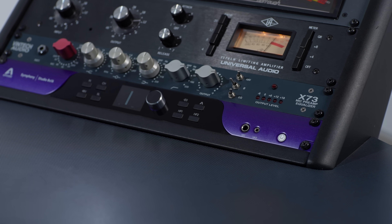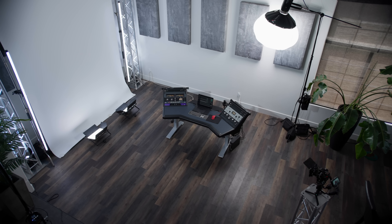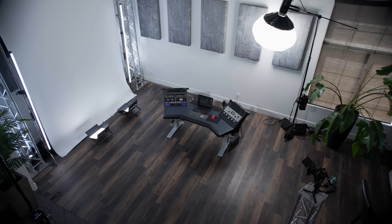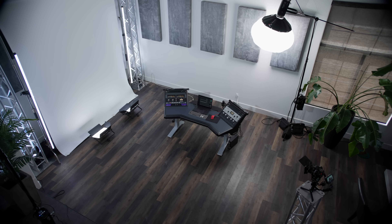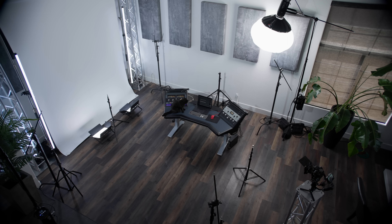The first thing I did was use my screwdriver to mount the Apogee Symphony in my desk, then pull my desk away from the wall so there's enough space for all the speakers to be equidistant. Having all your speakers the same distance isn't necessary, but it definitely simplifies the calibration process later. Next, place your four C-stands as corner stands that will hold your overhead speakers — but don't raise these up yet. Then place your seven smaller stands, which hold all the speakers at ear level: two in the back, two on the sides, and three across the front.